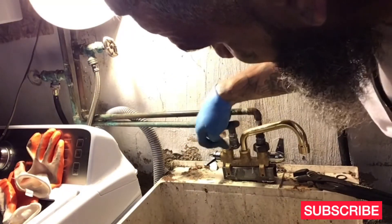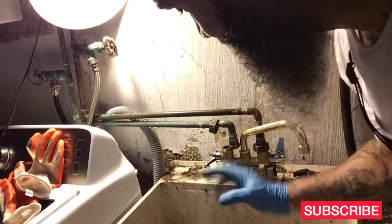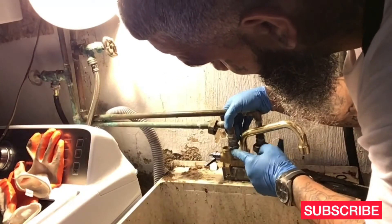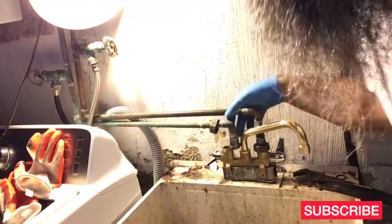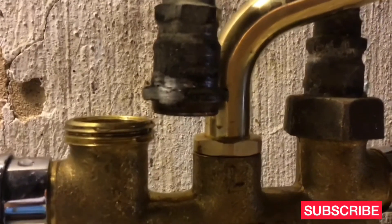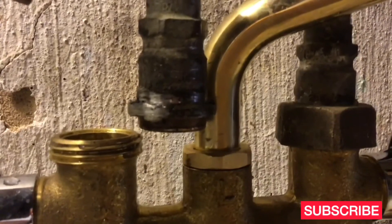The other one might've worked because it was already on there, or whatever the case may be — I'm not sure, I'm not the one that did it. But I know that once I get rid of this piece of lead here, where it needs to not be, it is going to work. You can see that's where the lead is at — it's dripping there. That little bit of lead right there is actually what's stopping it from going in. So I'm going to take that out, put some fire to it, melt it off, and hopefully it will work.